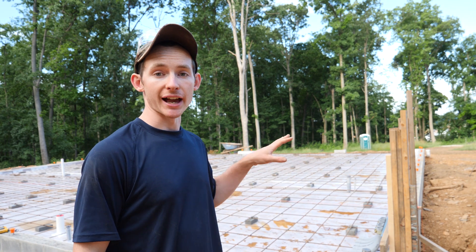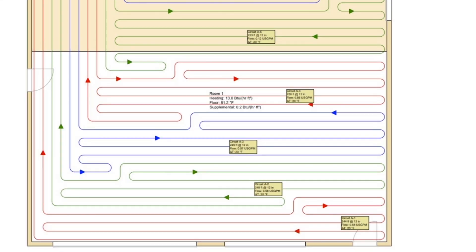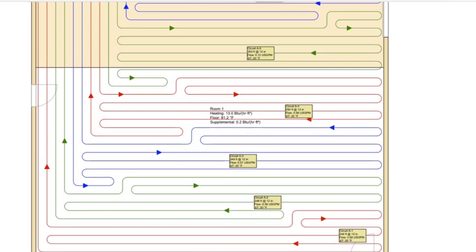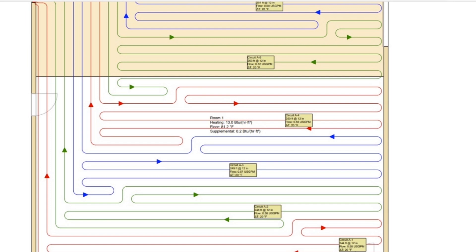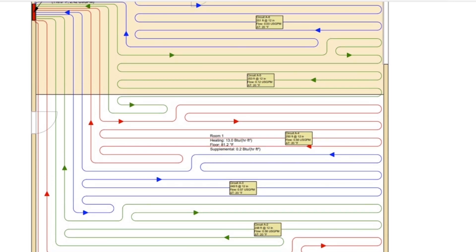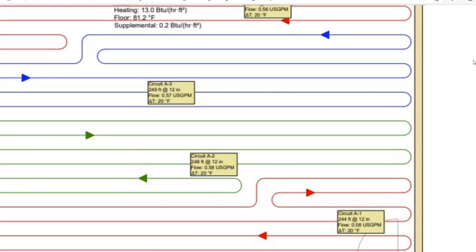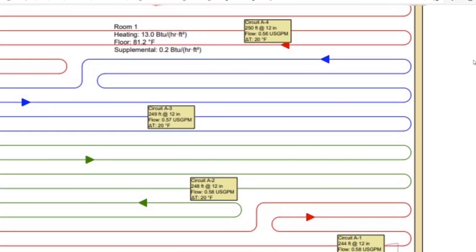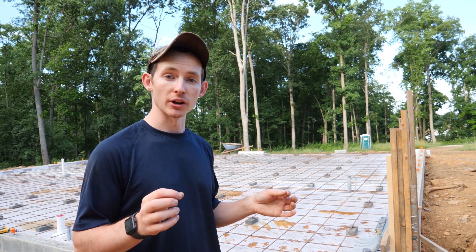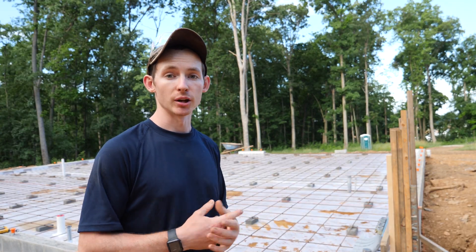I laid the tubing runs out using a program called LoopCAD. There are going to be six circuits, and it's important to keep the circuit lengths about the same. Using LoopCAD turned out to be a total game changer — I tried doing this manually in CAD at first and it was very tedious. LoopCAD automatically balanced all my circuit lengths and laid them out in a logical, easy-to-follow grid. It also optimized the direction of current flow for the best heat. Luckily, LoopCAD offers a 30-day free trial, which is all I used for this design. We don't have PEX with foot markers printed on it, so we're doing our best following the LoopCAD layout.